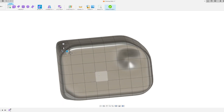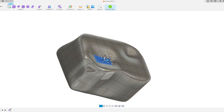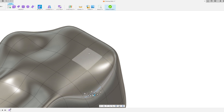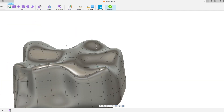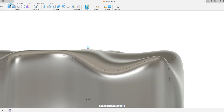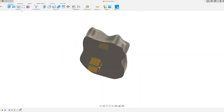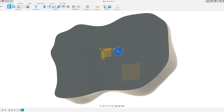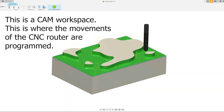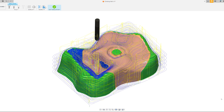I've been toying with the idea of designing some volumes to put on there too, which would be really fun for the kids and mix up the climbing experience. Fusion 360 has a form workspace where you can set up a chunk of geometry like play-doh and, using the nodes, vertices, and faces, morph and sculpt it into whatever shape you want. On some of the holds I added a plane of symmetry so they'd come out nice and even. After molding the basic shape, I cut a flat in the back to sit against the climbing wall and made a straight through hole with a counterbore to accept a 3/8-16 bolt — the standard for climbing walls — and a 3/8 washer.